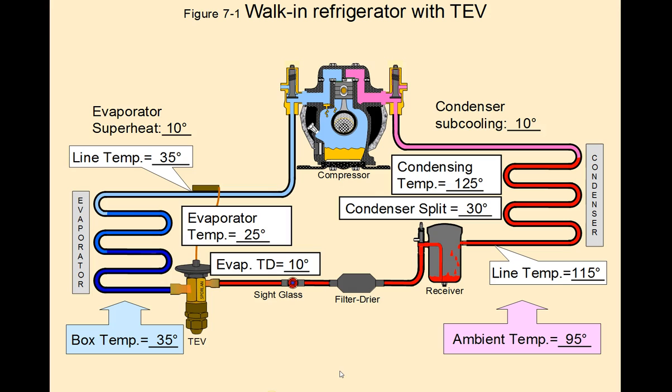One thing to note: if the ambient temperature drops below 70 degrees Fahrenheit, it's going to have an effect on your sub-cooling by increasing it, and you have to take that into consideration in cooler weather conditions. Also, if the ambient temperature rises above 95 degrees Fahrenheit, it's going to start to degrade the system's capability to refrigerate properly — anything above 95 degrees tends to fall outside of manufacturer's design. For all of these troubleshooting examples, we're going to be working with a 95 degree outdoor ambient temperature.